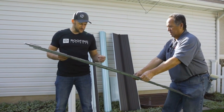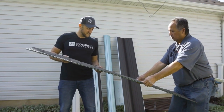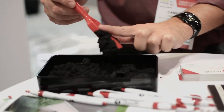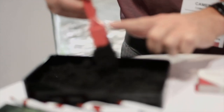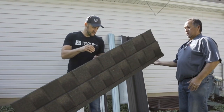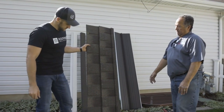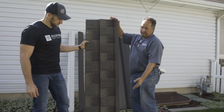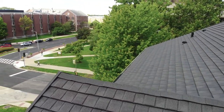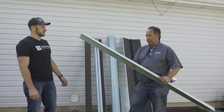The granules feel just like shingles. We're using ceramic granules embedded into acrylic — a clear acrylic glaze goes over the top, it's cured in the oven, and that's what gives us our limited lifetime warranty. It's lightweight: pound and a half per square foot installed. A normal size panel is roughly 48 inches in length with a 14-and-a-half-inch exposure.